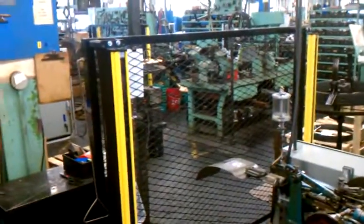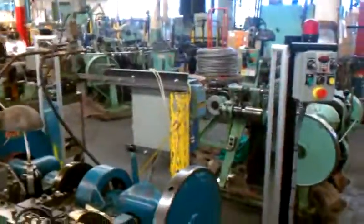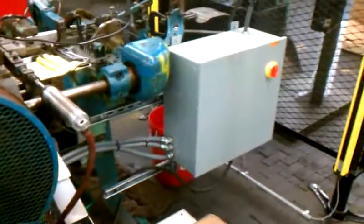This is your standard four slide machine. The entry point of the machine is guarded. There are two light curtain columns reflecting around two mirrors. On the left hand side we've completely cleaned the machine up, and everything's in a custom PLC control right there.